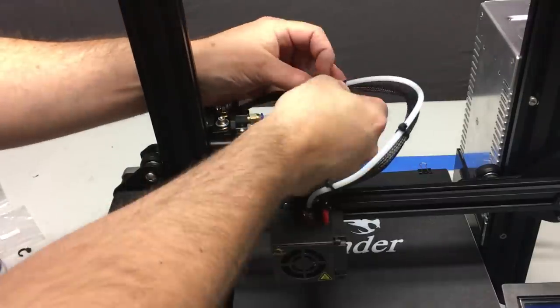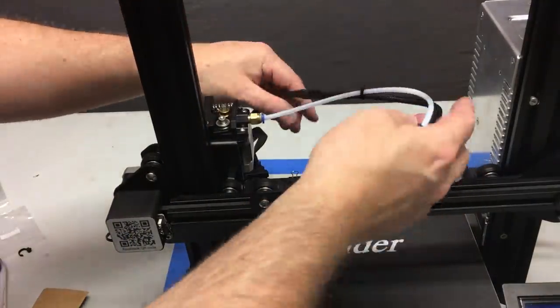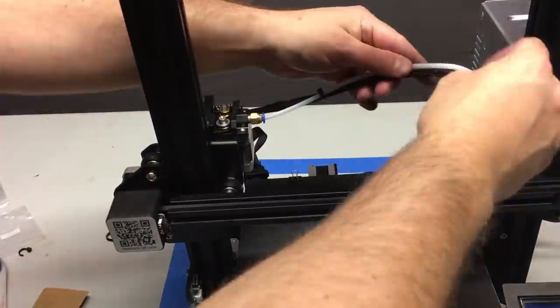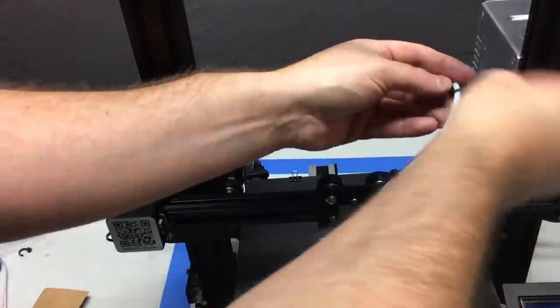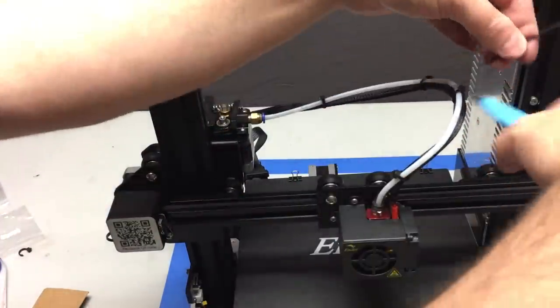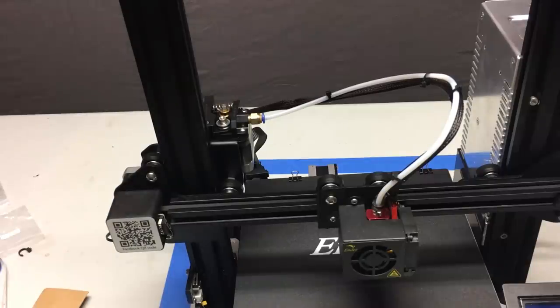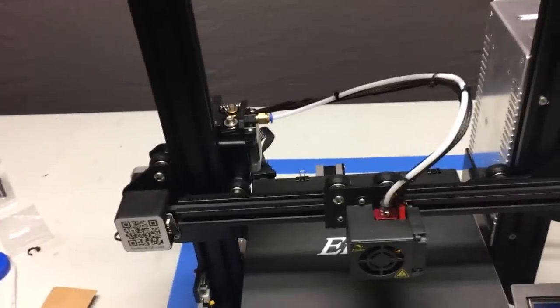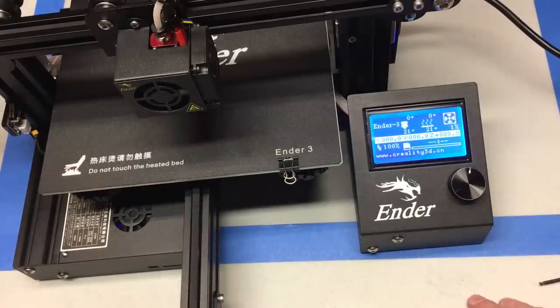Wiring management is essential on a 3D printer. As the printer moves the wiring moves, and as it moves you can break the little wires inside — some of them are pretty thin gauge. I strongly urge you to download on Thingiverse — it's linked in the description — a drag chain that you just print out on your new printer and add over the wiring harnesses. It'll make them a little bit stiffer, take the stress off from movement, distribute that stress over the length of the cable, and keep you from having to replace wiring for fans and such later on.